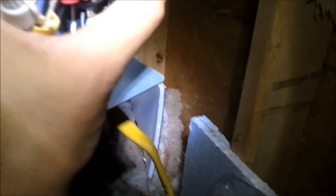Now that you have everything wired, got your ground back here. Got your white on white, got your black from the power going to one side of the switch, and then the black from the switch going up to your motor through your metal pipe here — or rather, I should say, conduit.